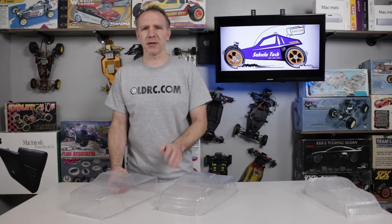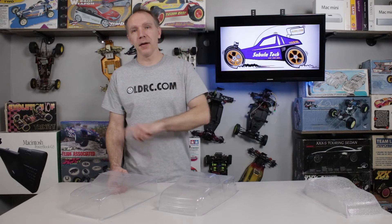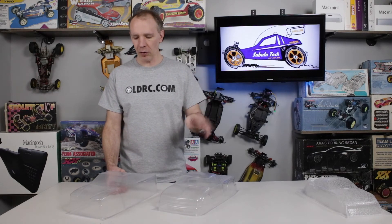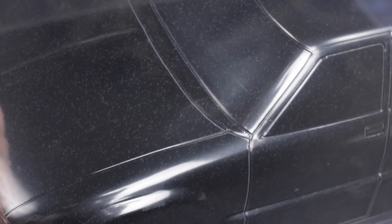That's all because they weren't dried long enough. It was one of those cases where we ran it, saw it looked bad, and had to leave the plastic in the drying oven another 15 to 20 minutes to get it dried out completely. We kind of jumped the gun with wishful thinking that they were okay. This one doesn't have the cool effect of the extreme example — it just looks kind of covered in dust, but it's really bad on the inside as well.